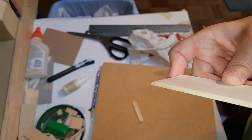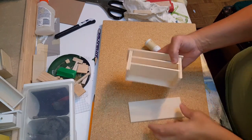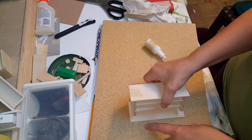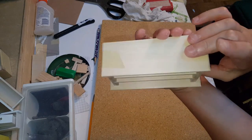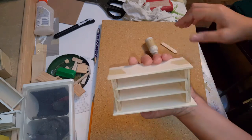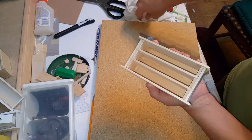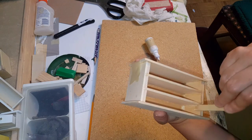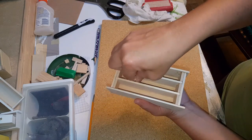You can also use a router if you like. Once you've beveled that, line this up and place it right on top to make it even on each side — remember that you marked it before. The bottom should be wider than the top. Then go back through and remove any glue that may have come out on your drawers because that's going to affect your drawers opening and closing. And we'll move on to the next part.